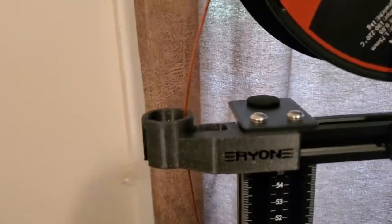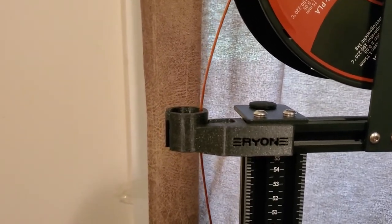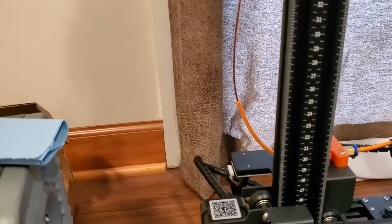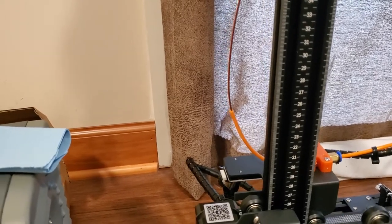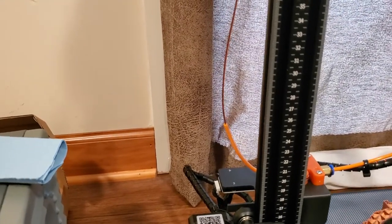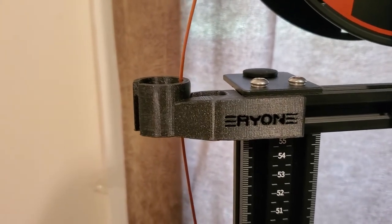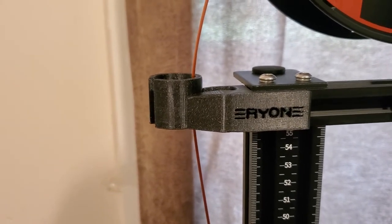I printed this filament guide that slides right onto the top of your frame. It keeps the filament from sliding across this relatively sharp edge — I'll put my finger in here — and it also takes it a bit out from the frame so that it enters the Bowden tube at a much better angle overall, keeping it at a relatively stable angle, which is really nice. Those two are really functional upgrades and they look really nice too. I printed this in Prusament Galaxy Black, but you could choose any color. I decided to stay with black for most of the frame upgrades, just for the sake of keeping them very understated.